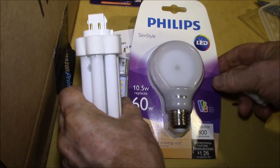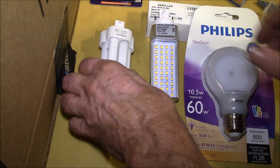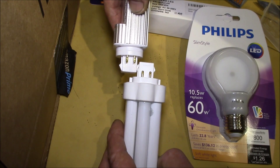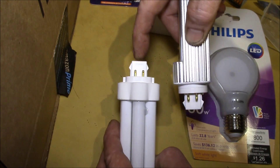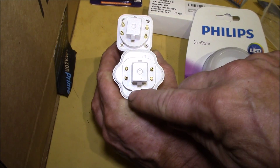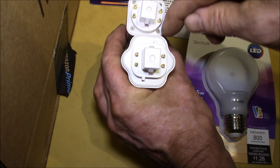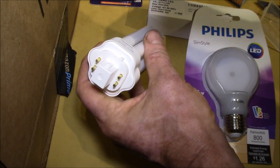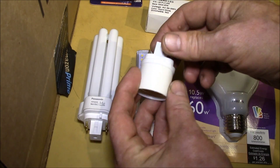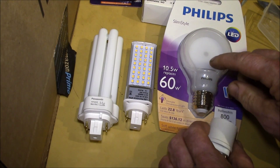These are my lighting options: the original CFL and the GX24. The G24s are about a quarter inch taller on the plug portion. The CFL has little tabs — there are three different combinations of tabs on the four-pin socket. This bulb has no tabs around the outside, which makes it kind of a universal bulb, but you have to disable the ballast. I also have this adapter, which is also a universal fit, and I'll use that with this bulb.